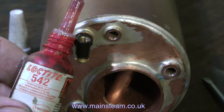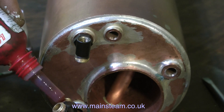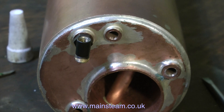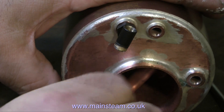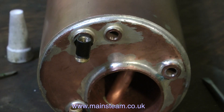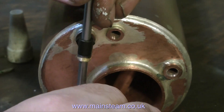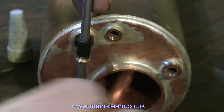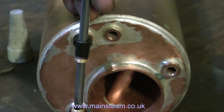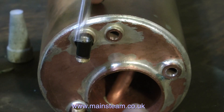Here I am with some Loctite 542, fitting the bottom part of the water gauge. I've found a suitable washer and it's just about to be screwed into place. It is essential not to over-tighten these parts — if you over-tighten the water gauge fittings, you could fracture them, and you won't really find out until a few months down the line when part of the fitting falls apart. Once again I'm making a final adjustment — it fits perfectly with my screwdriver. I would not dream of using the glass for this; until it's perfectly aligned, the glass will just break.